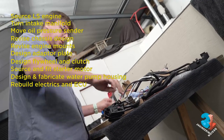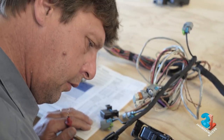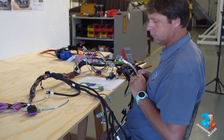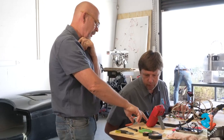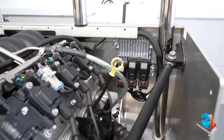While Jean was busy, Pierre set about the electrics — relocating various plugs, cables and sensors. With the ECU and loom now placed in front of the engine, the wiring to the injectors and coil packs all had to be rebuilt. Once that was done, the ECU also got the once-over to make sure that everything opened, closed and fired when it should, and that everything still talked to everything else.